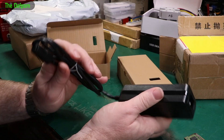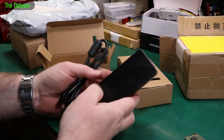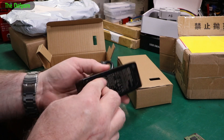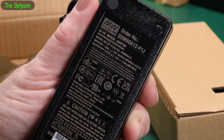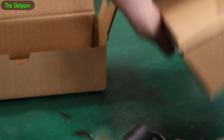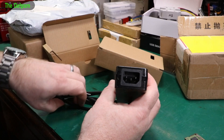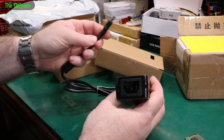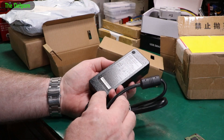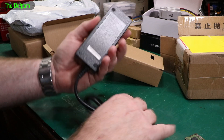Power supplies — Meanwell power supplies, apparently, so they claim. Meanwell is a good brand; I've had a good experience with Meanwell. They're recognized as being a better brand. It's a 12 volt 5 amp power supply — a couple of power bricks, I think they're both the same. These use a standard IEC connector, and it's got a 2.1 or 2.5 millimeter barrel jack. Hopefully it actually is a Meanwell — it may or may not be.